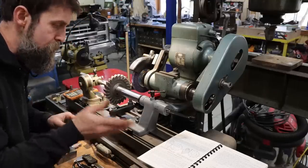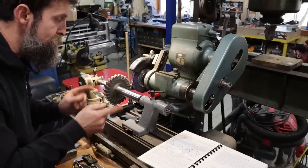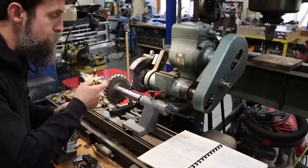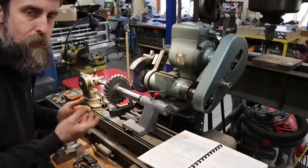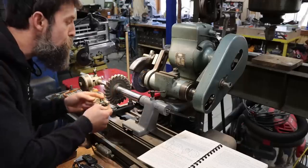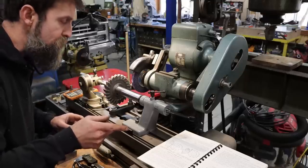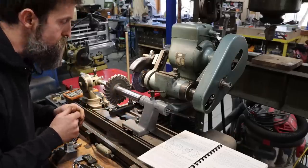Now, it's common practice, as the book says, to put in double whatever we put in for our primaries for our secondary. So I put in 6 degrees for our main cutting edge here, and if I was to double that, it'd be 12. That's what they would recommend for me to grind in for my secondary angle. I put in 15. For my needs, it's not going to make any difference, and if anything, it'll keep me from having to touch up that secondary if I ever have to sharpen this guy again, which I probably won't. But if I did, maybe it would help. So let me show you a photo of what's going on, and then we'll grind it in and maybe even try this guy out on the horizontal mill, see how it works.